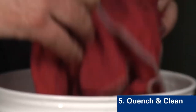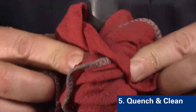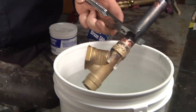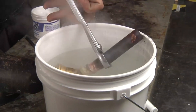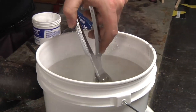Step five is to quench the part. This will shock off the majority of the flux residue. Wait until the filler metal has cooled below its solidification point before quenching. Make sure all color has left the assembly prior to quenching — this will ensure that the filler metal stays in the joint. Flux residue can also be removed in a bath of hot water, as fluxes are salts and will dissolve well into an aqueous solution at higher temperatures. The flux residue must be removed as the flux is corrosive.